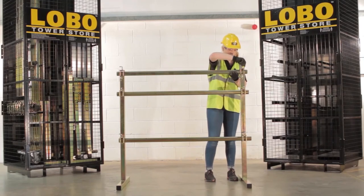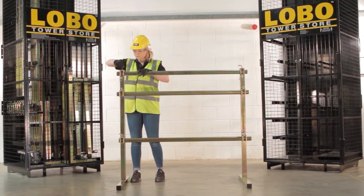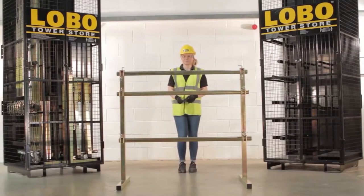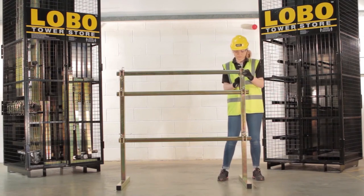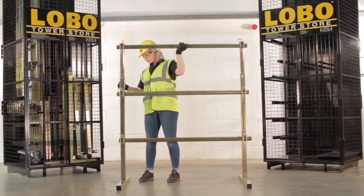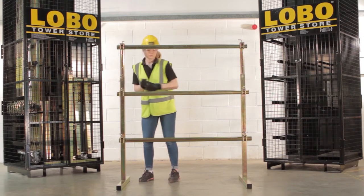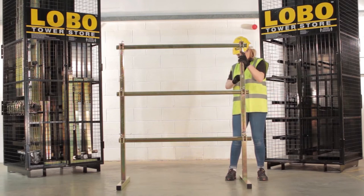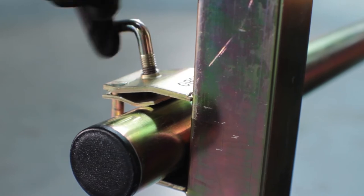These three tubes form the load bearing levels on the system, as they are all supported by a welded side or top clamp. The round tube can be raised to provide handrails as required by removing the height adjustment pin — always fully reinsert the pin and tighten the thumb screw. Here we can see how the round tube is inserted into the side clamp and tightened.